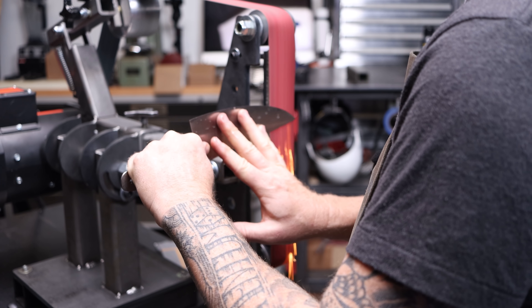What I love about this system is that if you had a high carbon face or even just mild steel instead of a soft back platen, any twisting motion this way or that way is going to create divots in your blade and it's going to be very obvious. With this system it simply does not — it's very forgiving, very soft. You could even do convex grinds if you want. Let's take this up another notch and go to about a 200 grit belt, then finish with a surface conditioning belt and some WD-40.